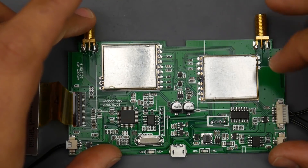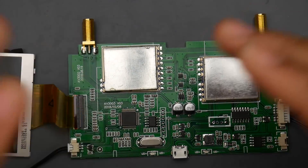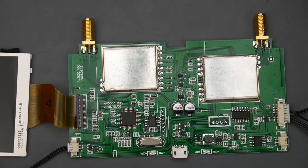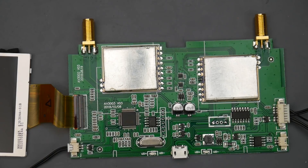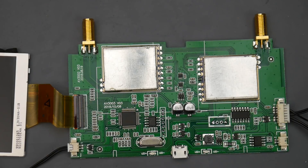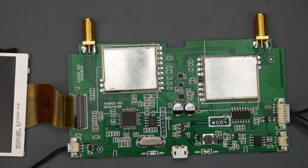If you had a patch antenna here I'd totally recommend setting a patch antenna on one side and a regular mushroom-type antenna on the other side. This thing does come with both antennas. The screen quality isn't that great, but for 50 bucks I don't think there's anything better currently. If you're looking for a cheap alternative, I'd highly recommend the Eachine EV800D's.